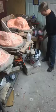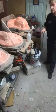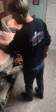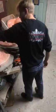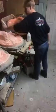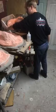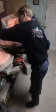The other thing we're going to use to do this is Bondo. Same can you get at Lowe's, same thing you use to do the body of your car. Depending on how thick you want the Bondo to be, or how thick your beauty coat. The beauty coat really almost isn't necessary on a silicone mold. It's not a bad thing to ever do, because it's going to help the fiberglass fit in better. The Bondo is going to fit into the small cracks and the little goo of this thing. Oh, there's a chunk here.